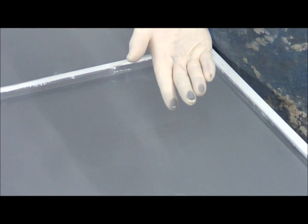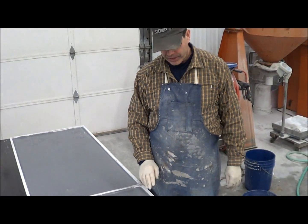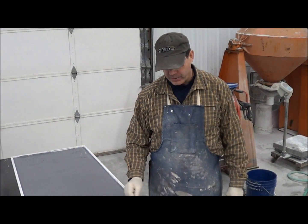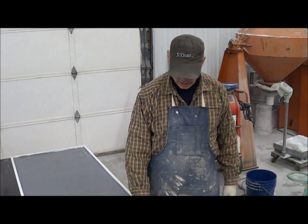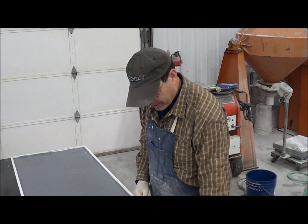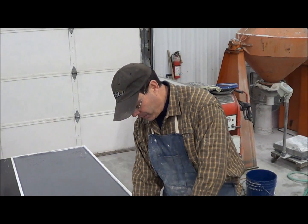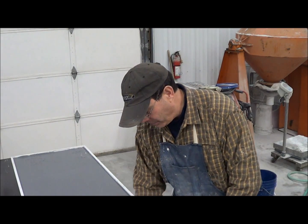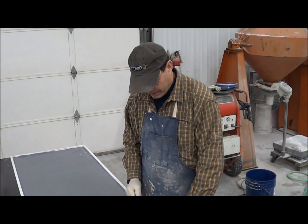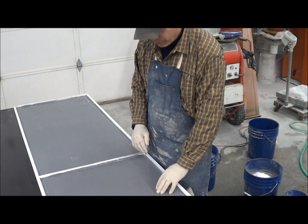If you rub your fingers, you can remove some material almost like floating — you could float up a little bit of material. That tells me I'm going to have good adhesion. Now, if I were rubbing and rubbing and wasn't getting anything up, I would probably paint on a bonding agent quickly: Acryl 60, 50-50 with water. Paint it on there, work it up a little bit, put your back coat on and you'll be fine. The safe thing to do is to wait longer rather than too short. If you put a back coat on too soon and move the face coat slightly, you'll get almost striations and different colors in the face coat. But if you wait long enough and don't disturb the face coat — this is a self-consolidating back coat so it'll be all right — you won't disturb the color. You'll have a nice uniform color.